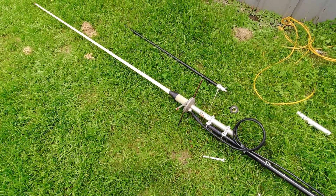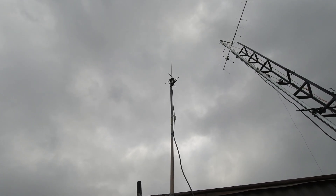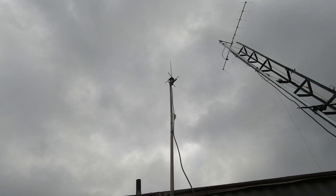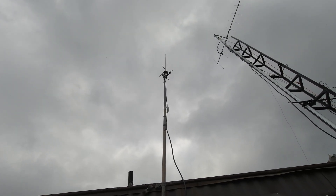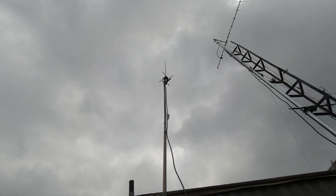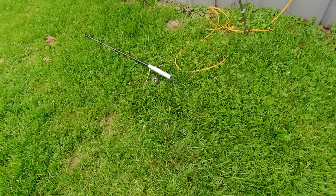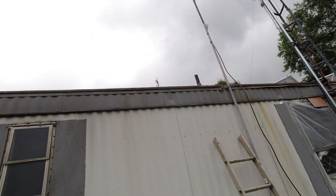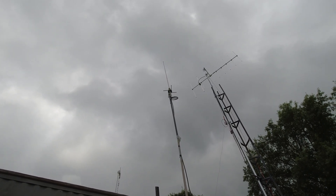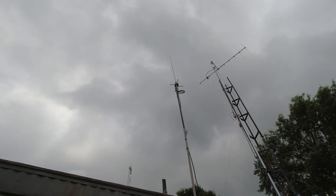We've made some progress — the new antenna fit inside the clamps of the old one. The adapter uses an N-connector with SMA connectors going to the SO-239, with a choke and all that good stuff. We got her up there, 20 feet off the ground next to my tower. Now we need to go inside, scan the GMRS bands, and try to get into the repeater. This antenna starts at 460 MHz, right where the GMRS bands are, so it should be a good improvement.